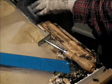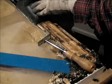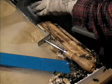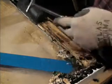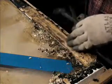Now I think I was actually steaming for about 1.5 minutes on that last section. So on this one I'll just try steaming for 1 minute. That might help prevent that wood surface scruffing up like that. All right. Well, that's soft enough for the putty at less than 1 minute. And the paint as well. So a little shorter steaming time means less likely to have wood surface damage.